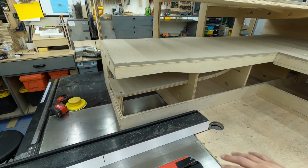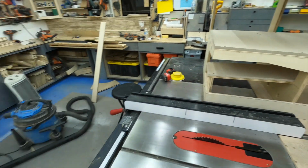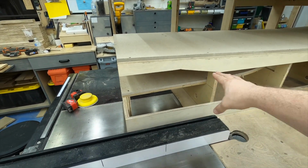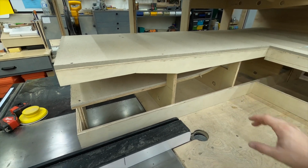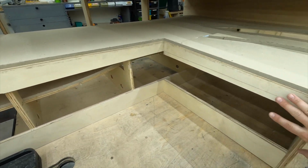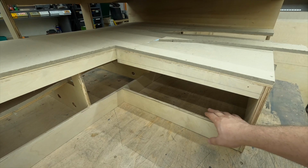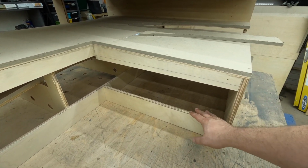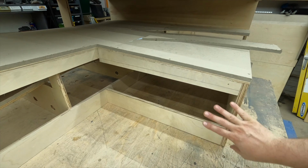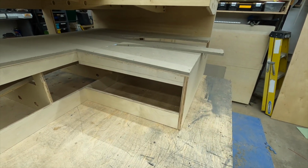Another thing is this little notch here, you saw me make that. That was specifically so it lines up with the adjoining module, which is over there at the moment. So I wanted it to look consistent, and then I knew I needed to drop it down so I had some extra thickness, so I had some more meat. So I did go ahead and make that a little bit thicker there, and then it wedges down a little bit. The reason why I did this piece here too, and keep in mind this is also on a slope, is I wanted to make sure that this distance was consistent. So we could use this as his DCC shelf, or we could turn it into a closed cabinet. And once I get this installed and talk to him, then we can talk about doing an upgrade. But I wanted to make sure that it was set up for it.